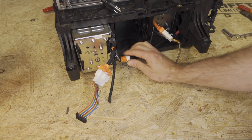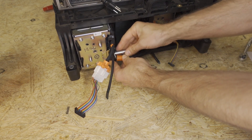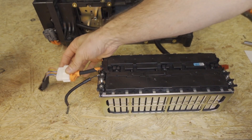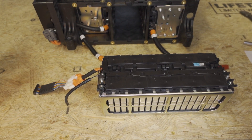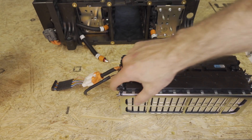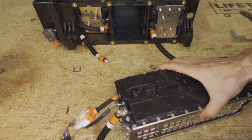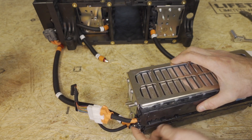We're going to go ahead and connect the negative terminal. At this point this is still technically not high voltage because we haven't connected the other side. Then we'll slide that back slightly. Next we're going to take module 2, which is the 18S minus module that does have the nylon fabric over it. We'll install the last cable which is bay 2 minus — this is an 18S minus, and the negative is over here, which you can double check because we wrote negative right there. Attach this cable down, with the high current side of the cable below the BMS connector, and then slide it through this hole.